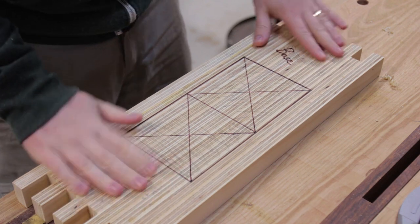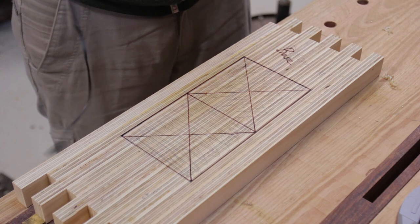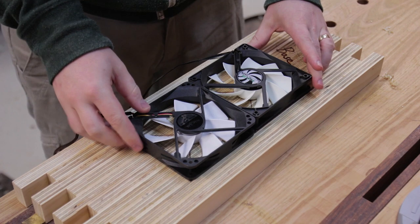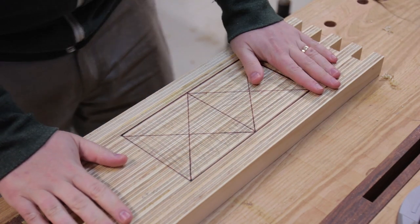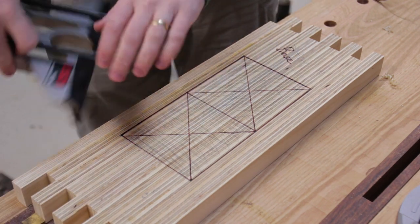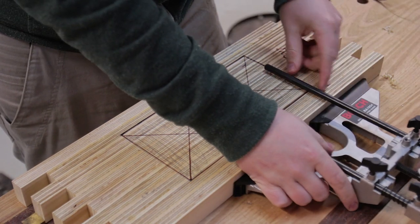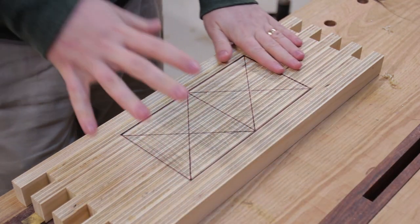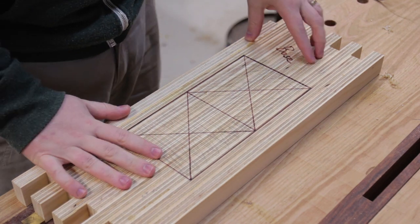This exact layout will be in the plans, but I've basically just centred the two fans on the piece of plywood, and that gives us a few advantages. It's going to be the same on both panels, so with our edge guide we can start at one edge, go along, flip it onto the other side of the panel, and do the same on the other panel as well. We end up making fewer changes to the router setup, which makes it a lot quicker.